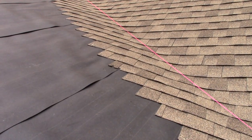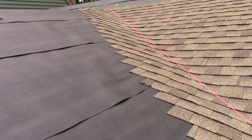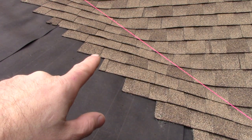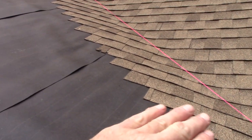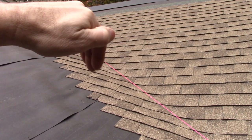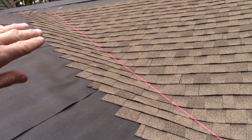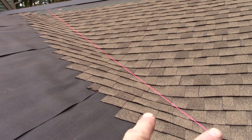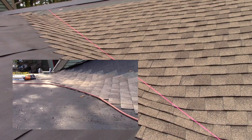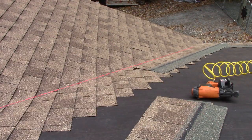That string represents my valley as far as where I'm going to put the course going up this way. My friend was telling me: you throw a course up there, you come in perpendicular, and you won't even see the perpendicular one. In my mind I couldn't quite picture it — that's why I'm showing this, because I couldn't really find much on it. So these shingles are about 21 to 22 inches going up the slope. When I plug in this way, as water comes down it's got protection — not to mention the ice and water underneath and the tar paper.